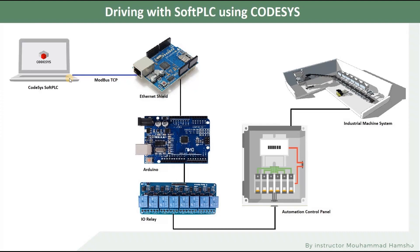So we'll learn how to do all of that. This Ethernet shield will be mounted on the Arduino, and then the shield is going to activate a set of relays in order to control the equipment inside this automation panel. Now the voltage here is actually 24 volts, so the Arduino cannot directly activate industrial relays and contactors — we need an intermediate. These intermediate relays work with 5 volts, so we can activate each of them using the Arduino. Then from the contacts of those relays we can conduct 24 volts in order to control the real industrial equipment inside this automation panel.